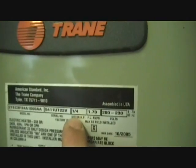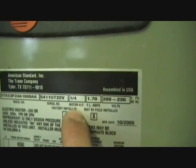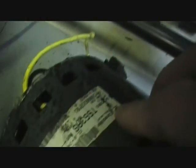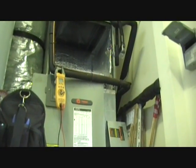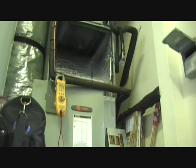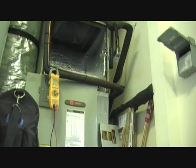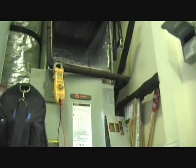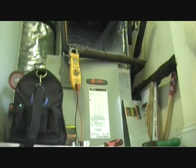If you see right here, you have your quarter horsepower blower motor on the label. Even though you'd match your blower motor to that and find a quarter horse motor, what was strange - if I come down here and look at the motor itself, it's actually one third horsepower. That was kind of strange, so I called the Trane parts place and they actually said it was supposed to be one third horsepower - it was just a mistake made on the label. I don't know how many are made erroneously, probably a lot. But it makes you think twice - make sure you check what you're working on, just to make sure. I'm gonna go pick up my third horsepower motor.